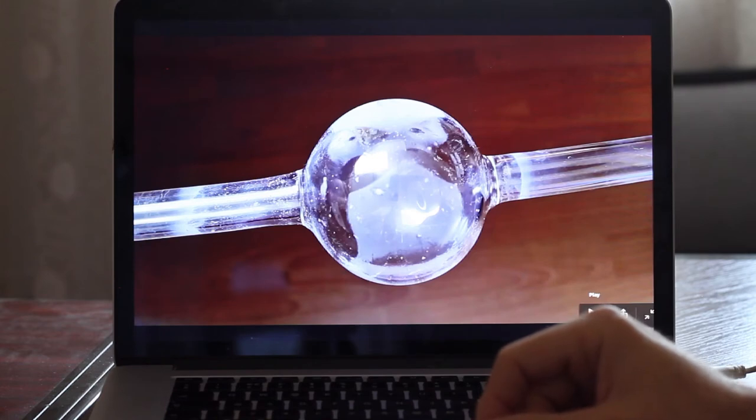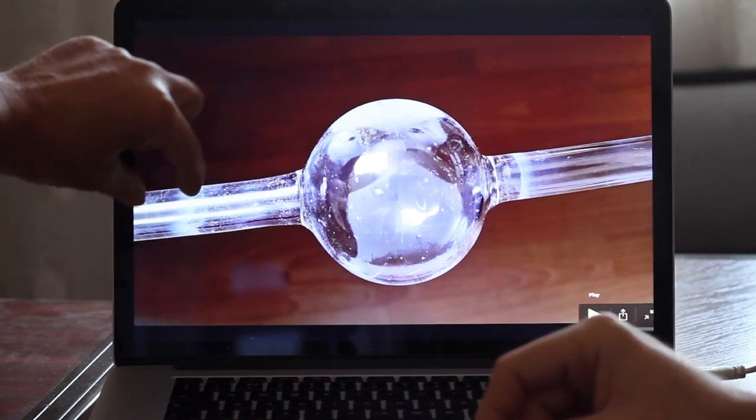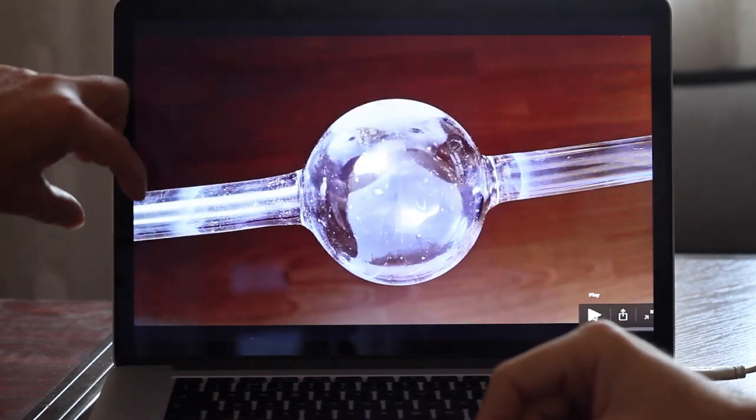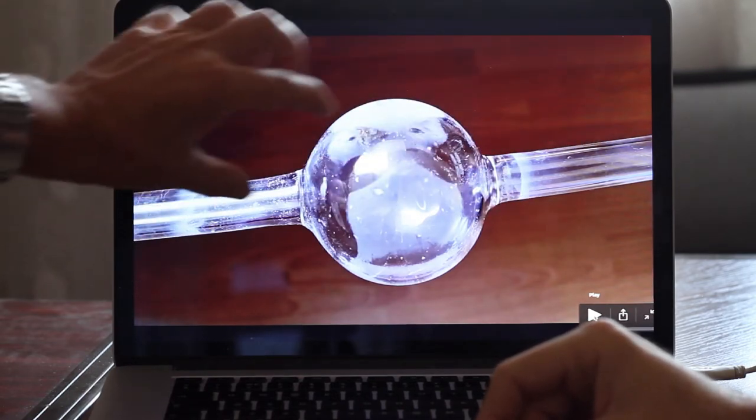So you call this a handle, and that's something that sits outside of the microwave resonator? It's a very complex acoustic resonance, actually, because the plasma is somewhere here. But the hot air sitting at the end of the tubes acts as a mass. The plasma is the spring, and the hot air at the end is the mass, and together they start to oscillate. If you are able to tune it to resonance, it can have a very powerful acoustic resonance. So it is not only the plasma that oscillates, but the plasma is coupled inertially to the ambient hot air.